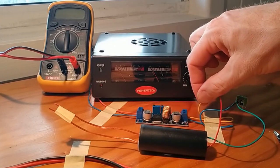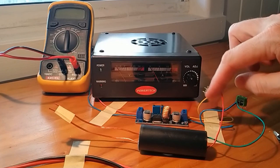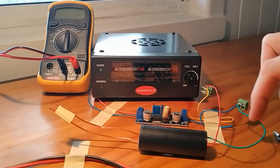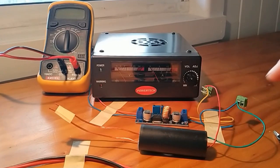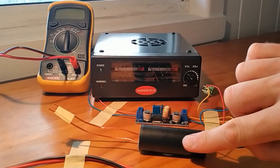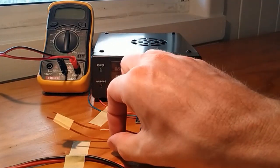So here's that yellow wire and blue wire. The yellow runs into the positive red wire on this particular module, and the blue wire, or the negative on this side, runs out onto the green wire here. Then what I do here is I follow the red wire through, and I assume that on this particular side, which is the side closest to the camera, is the positive wire.